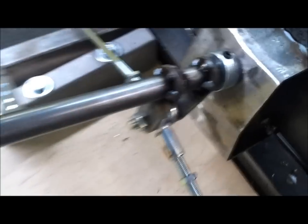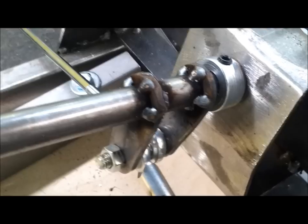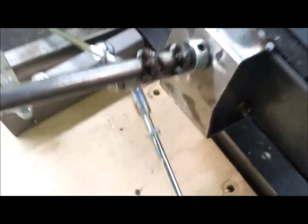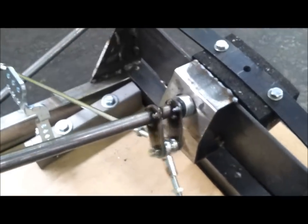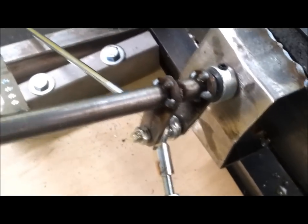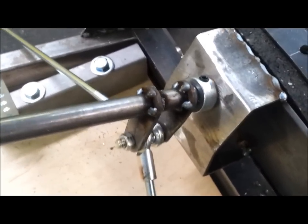And then I also welded the pitman arms. They're still a little warm. They're tacked on right now. I can finish welding them later. But you can see we have action here. The tie rods aren't hooked up yet. I still got to work on these spindle brackets. But you'll notice the pitman arm points straight down. That gives you right, left when you turn the steering wheel.